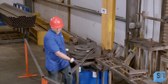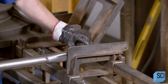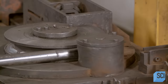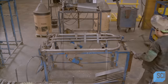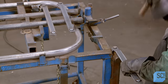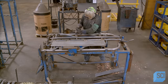Next, a machine bends steel tubing against a circular form. After the first bend, the worker repositions the tubing so the machine can make the second bend in the correct location. The tailgate frame has taken shape. With the frame in a jig, a worker welds vertical bars and diagonal linkages to it. He also assembles a metal shield to the lower half to keep the cow's hooves safely inside.